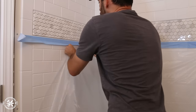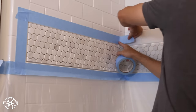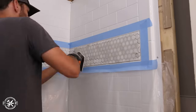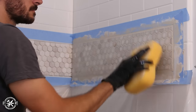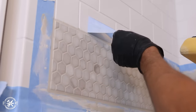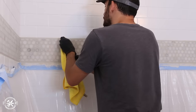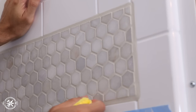The grouting stage is similar to other grouting. The only thing you need to do here is mask off the surrounding areas. I used painter's tape and clear plastic to keep the grout from scratching the acrylic. Then I mixed up some unsanded grout and worked it into the mosaic tiles. I did both side walls first, then came back and wiped off the excess grout with a sponge before it could dry too much. Then I moved on to the back wall and did the same process. After that I removed the tape and worked the grout joints around the edges — I'm glad I did this because I definitely had some bleed over. Working the joints before they fully hardened let me still shape them and correct any issues. I finished up by buffing off as much of the grout haze as I could, then came back and got the rest the next day.